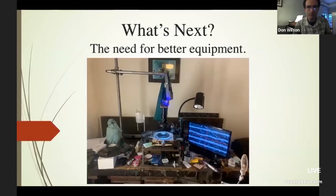This is technology that I've pushed quite hard, being able to recreate a disc with a groove width of only 20 microns, making it significantly smaller than even a microgroove record. And the fidelity of that recording was respectable. But this has been done with fairly rudimentary equipment that I've been able to find by buying an entire lithography studio off of Craigslist and various other industrial and chemistry-related goods that I've been able to find and cobble together. But this is technology that I feel is really worth pursuing further.